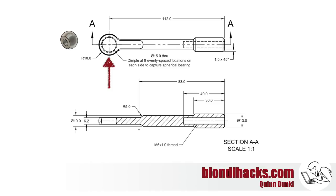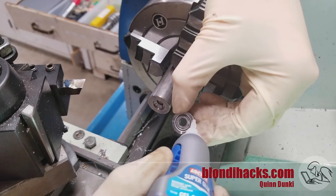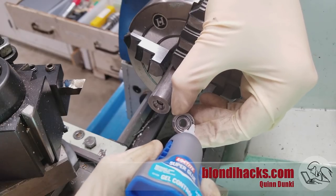There is just enough excess material that I can do this. When I'm done there will be two millimeters of aluminum on the barbell part and one millimeter of steel remaining around the spherical bearing part. That's not a whole lot of strength, but this is just a decorative piece for the Apollo 50 project.